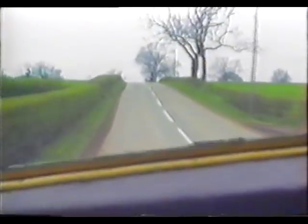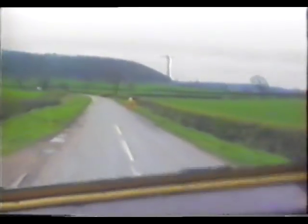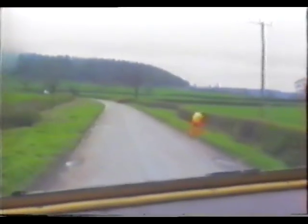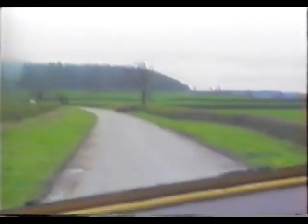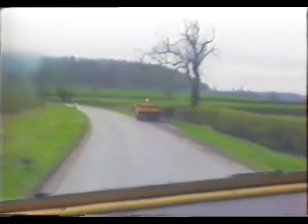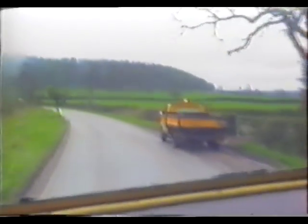If that would have been full of water, it would have gone over at that stage. If you are having difficulty transferring from four-wheel drive to two-wheel drive, the procedure is as follows: simply put the vehicle into reverse, travel backwards a short distance, and try it again.